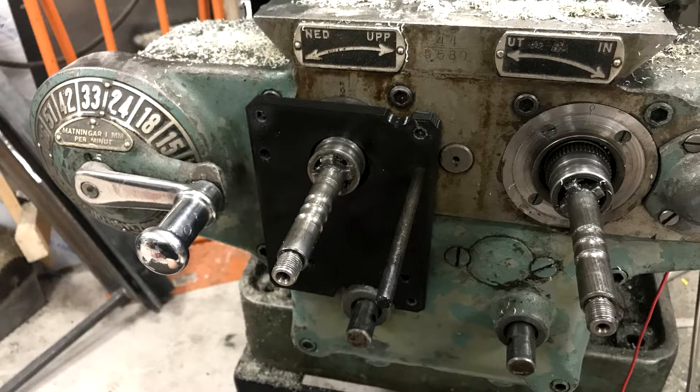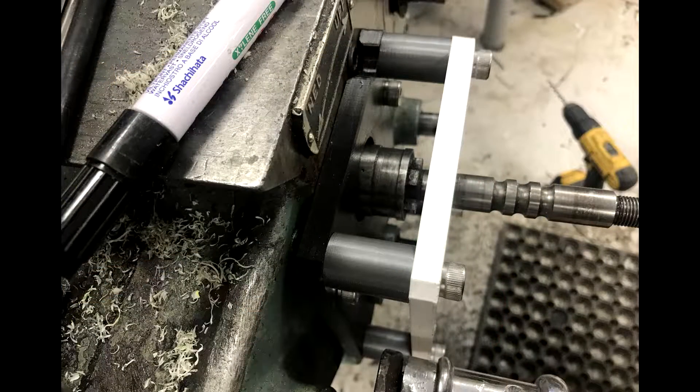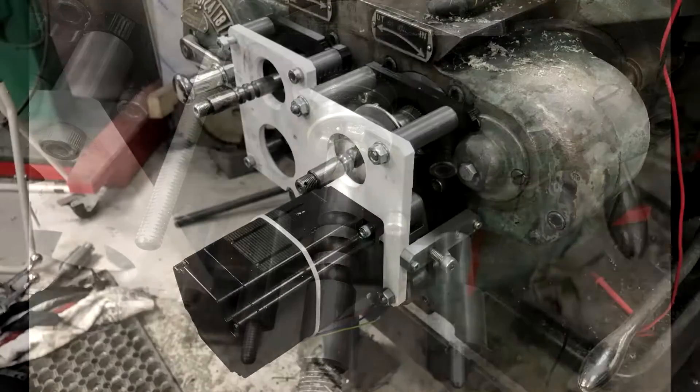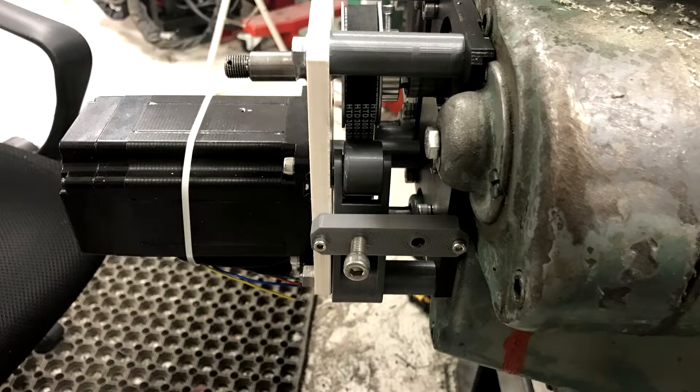With the PC and software parts done, I started looking at the mill. I did a few templates with paper, then moved on to CAD-ing everything up and printing the pieces full scale. With these templates I could then use a transfer punch to get my holes perfectly aligned. Some drilling and threading later, I started attaching everything to make sure my CAD models made sense in real life.